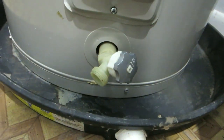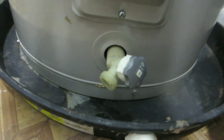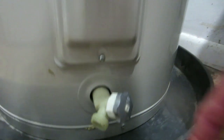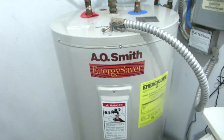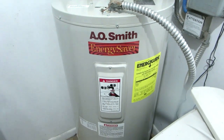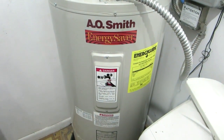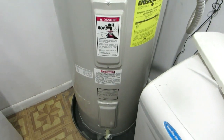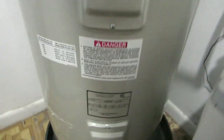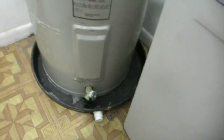What you'll be watching: you hook a hose to this little valve down here, take that hose outside, and open up the little valve. Best way to do it is just open it up, leave everything going up top, and flush it out until the water is running clear. A minute or two should do it. Do that once a month and it'll stay that way.